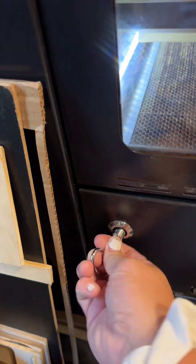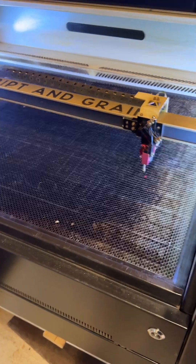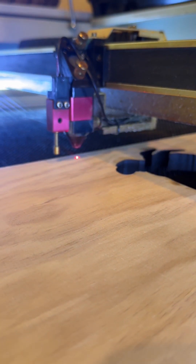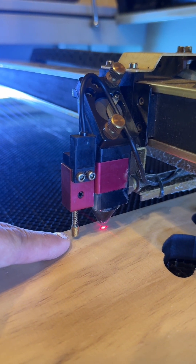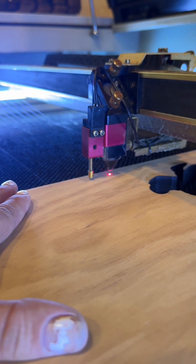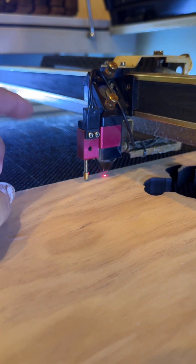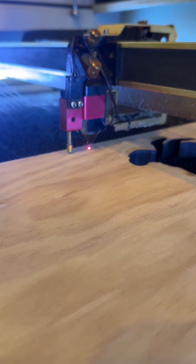I open the front pass-through slot, lower my laser bed a little bit, send the gantry all the way to the back, and load the wood. Instead of finding the focus point normally, I raise my laser bed up just enough to engage the auto-focus pin. A couple of warnings: make sure your laser bed is level and your wood is as flat as possible — otherwise run it through a planer or find a different piece. Raising the laser bed changes the focal point of the laser beam to go deeper into the wood, which allows me to cut that deep.